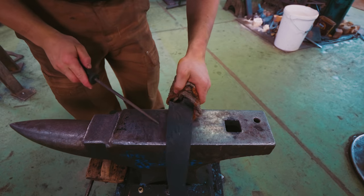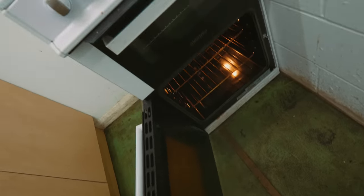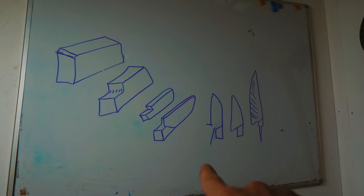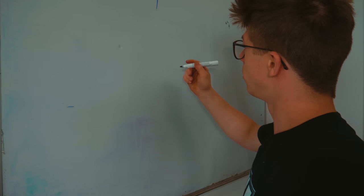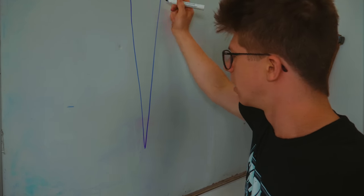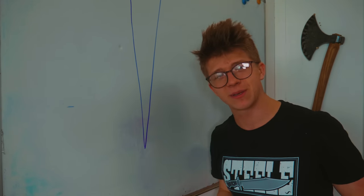It's hard. It's time to temper it. Into the oven we go at about 195 degrees Celsius. This is going to want to do, ideally, two cycles of two hours each, for a total tempering time of four hours. Now, why is this so important? If you want this progression for later for making your own knife, screenshot it now. Why are we going to all this effort to temper it, taking four hours out of a busy workshop day?